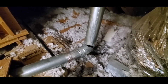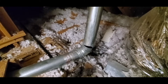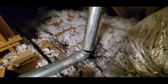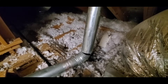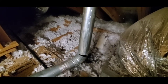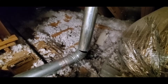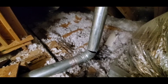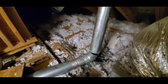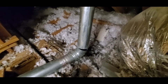Another reason is that air being exhausted from your dryer is warm, moist air. And if it's being dumped into your attic, you have several concerns. One is the lumber — which is everywhere in an attic — is sensitive to that warm, moist air. Another reason is that warm, moist air can be a good condition for mold to grow.